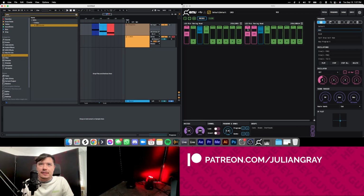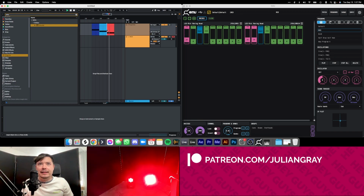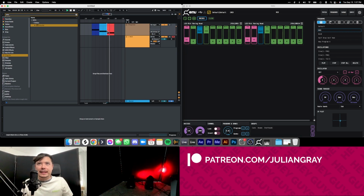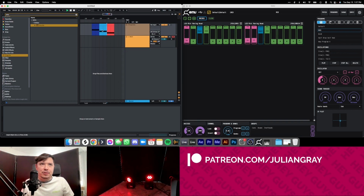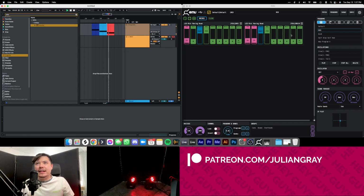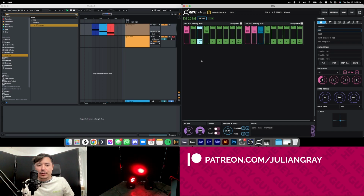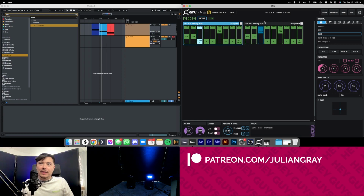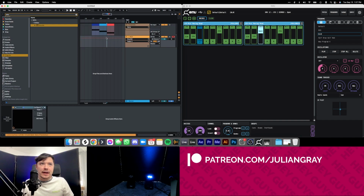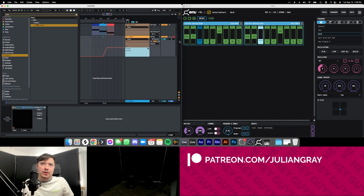What I would do is use the programs to select the color. So like you want to grab the red color, and with this certain tilt motion or pan motion with that program, and then you use the dimmer to do the more elaborate animation controls. Like if you wanted to have the left side go and then the right side go over time, you can do it like that. So if you actually go into automation here and you automate them, fader 2 corresponds to light 2 dim, fader 1 corresponds to light 1 dim. So you can actually do what I was saying.